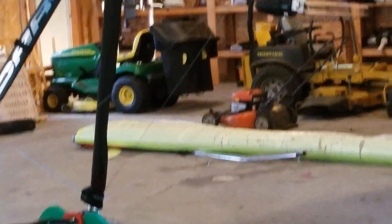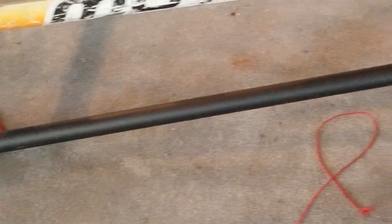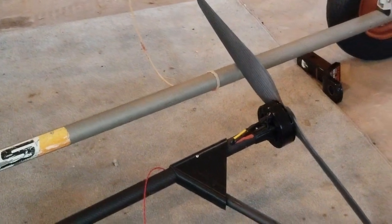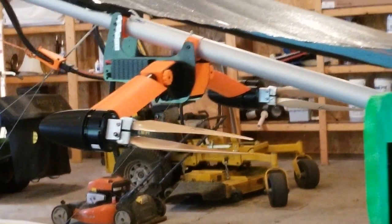In addition to the twin-engine sustainer, I also built a carbon e-help. Anyone who's been following the e-help project — most of it's connected to the harness — but you can see here's a carbon tube that runs out to a 36-inch by 14.5 carbon prop. This puts out about 30 kilograms of thrust compared to the 20 that this little unit does.